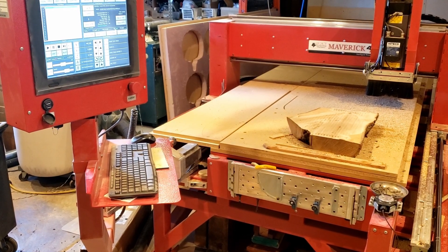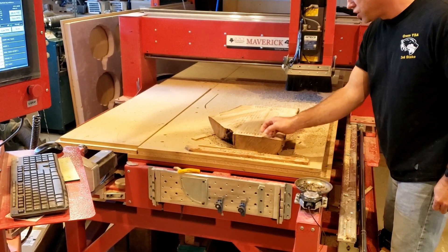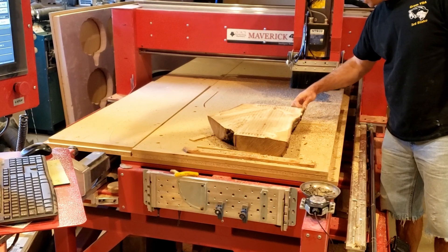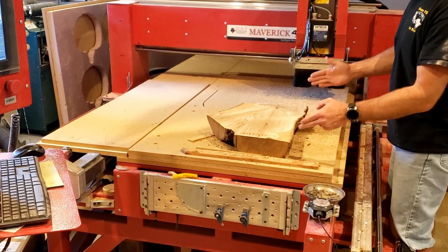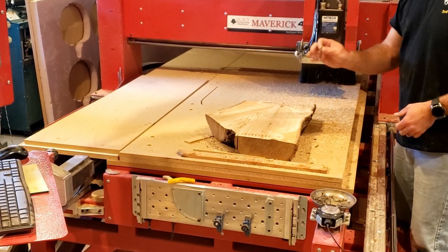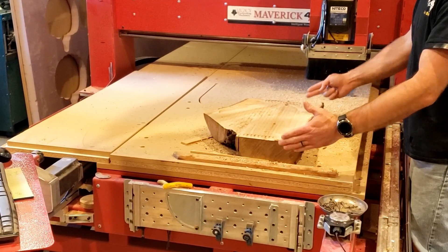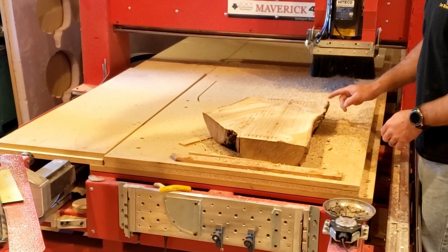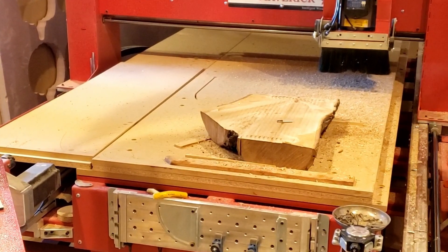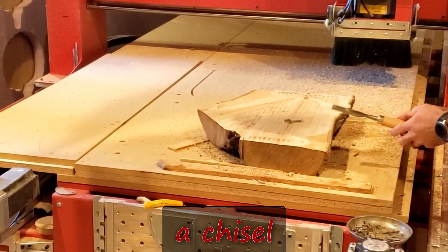What I noticed as this was cutting is that I'm 0.2 inches over too far that way, and I missed a 0.4-inch corner right here — I made my envelope a little bit too small. When I noticed that while it was running, I came in and adjusted the toolpath, increased it to a negative 0.5-inch tolerance, basically making the envelope half an inch bigger so it should encapsulate all of that. Rather than leaving those bits sticking up, I can just rerun the toolpath and shave that off.